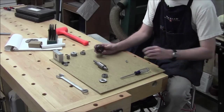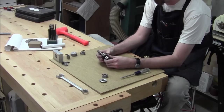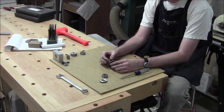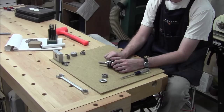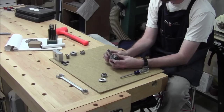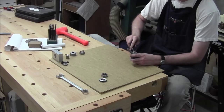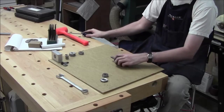Now we're ready to do some assembly. I need to put the gear on before I start pressing bearings, so I don't have to pull the bearings off to put the gear back on later. We're just going to toss these in here right now with the set screws just to get them in place. The gear and the screws just need to go in for now. These are not the final screws — they stick out way too far and might bump some stuff during assembly — but I need the gear in place and not flopping around, so we'll just throw this on there for now.